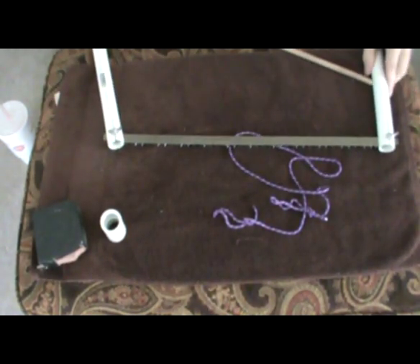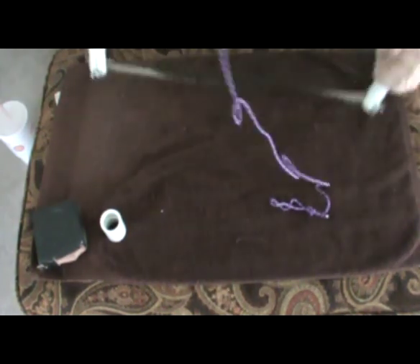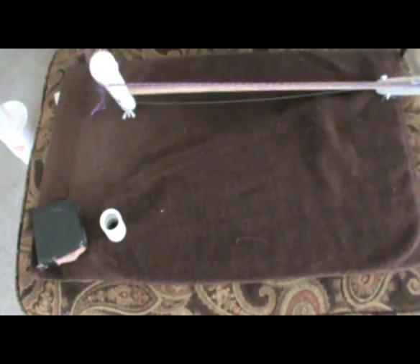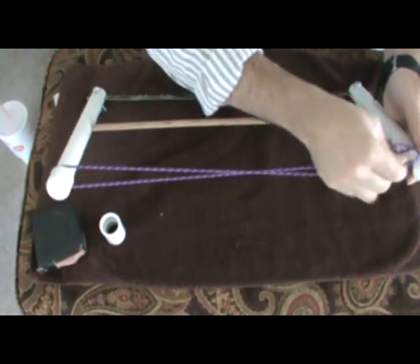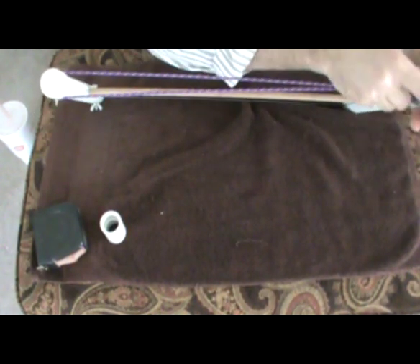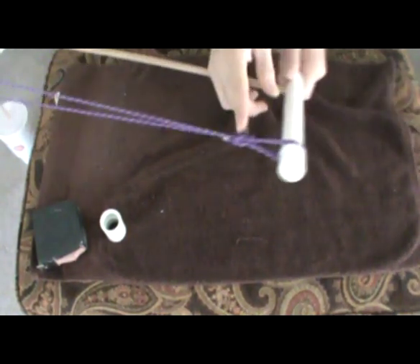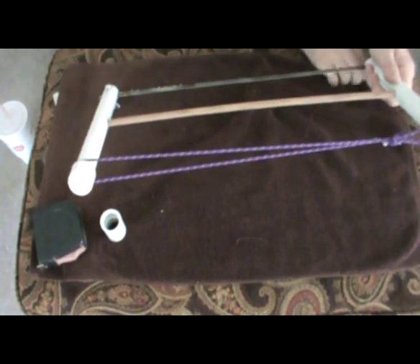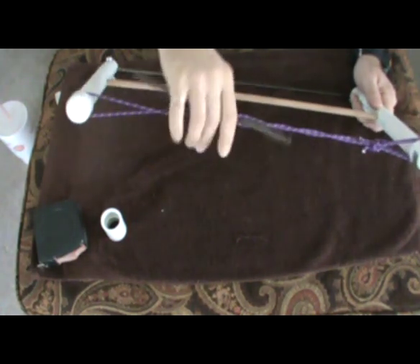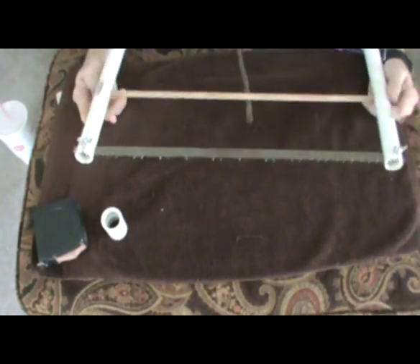Spread it open a little bit, put your toggle in one side, fix your toggle on the other side. Take one of the fixed loop ends of your rope, put it over the handle, wrap it around the other side, and then take your other fixed loop and slip it over. The length of rope is up to you — it depends on how much extra you want on the end, so I'm not going to give you the dimension for the rope. Then go find yourself a stick on the ground, twist it in there three or four times, however tight you think is sufficient, and there's your portable buck saw.